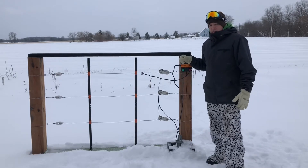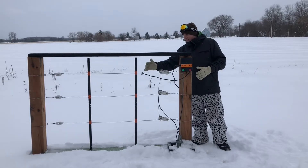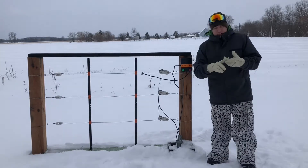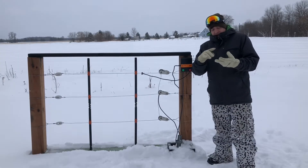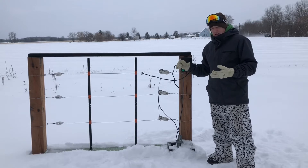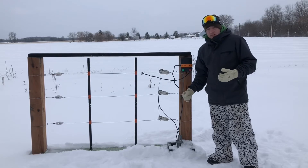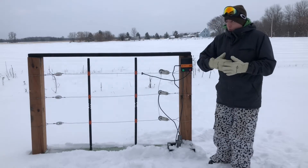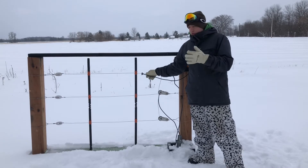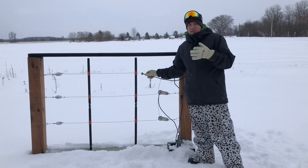The reason why we attach the ground rod and not directly to the energizer — at least what I recommend to my clients — is that if it is all attached up here your entire system is floating. That means if there's any shorts, any electrical surges, or if there's any lightning that hits your fence, everything has to go back to the box to get discharged and you don't want that to happen. You want to have that extra layer of protection. On top of that, when the conditions are normal — let's say in spring and summer — you still want to have that typical just-touching-one-wire response so that when they're testing it, they don't have to lean up against the fence and cause damage.